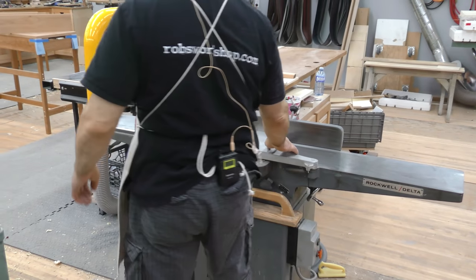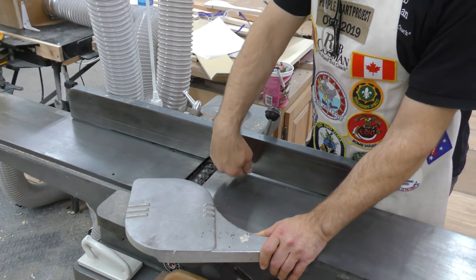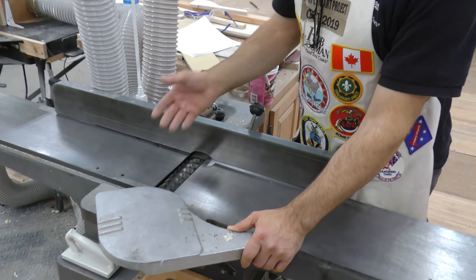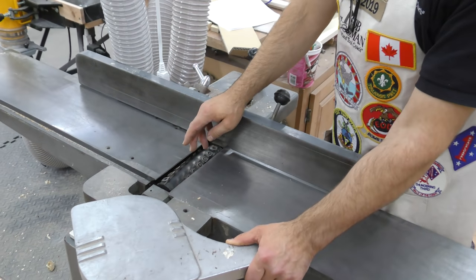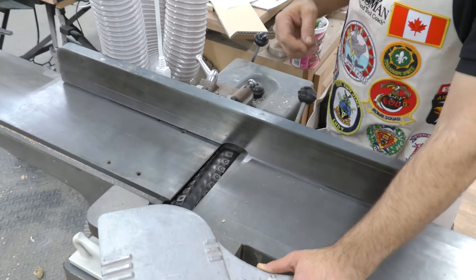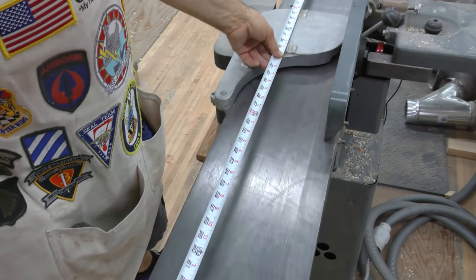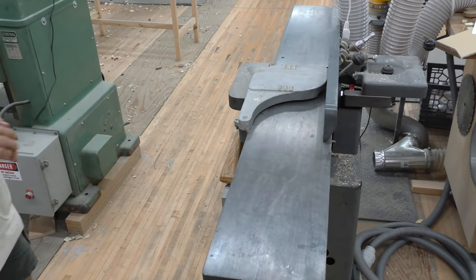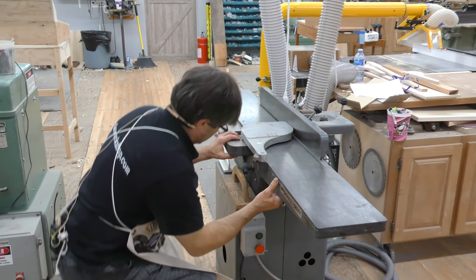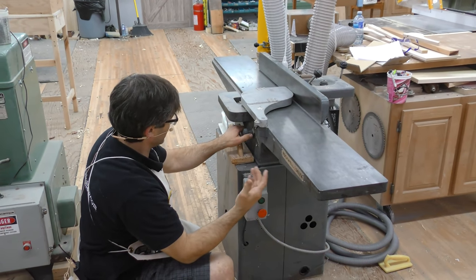Just a really good solid machine with a good solid fence, completely adjustable. I rarely ever have my fence anything but 90 degrees, but this is designed so you can tilt it as much as 45 degrees in that direction. You can move it forward and back to expose or cover more of the cutter head. This has the segmented head — I did a video on that recently — and this is probably next to the SawStop the most significant improvement in woodworking power tools in the last 50 years. The cast iron length — the longer your jointer is the more accurate it's going to be. I think this one is about five foot seven inches. Height is 32 inches which is a nice working height. The depth adjustment is a spin wheel and this one needs to be loosened up a little bit — it's kind of stiff, we just bought this not that long ago and I've been in the process of restoring it.